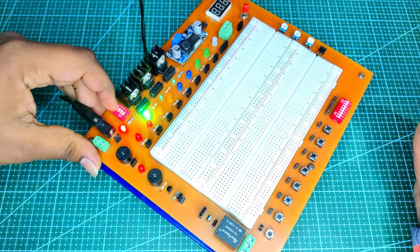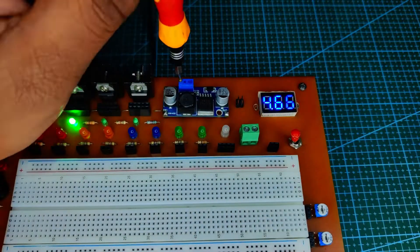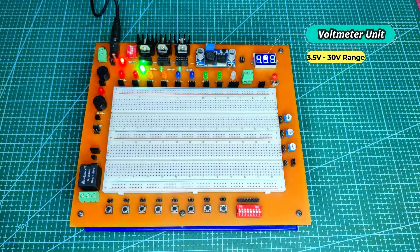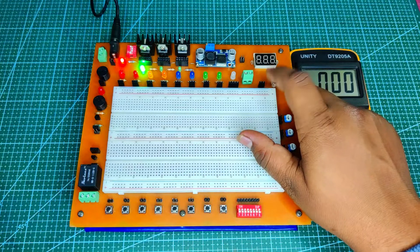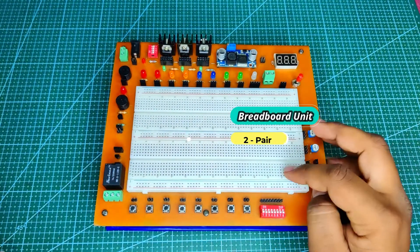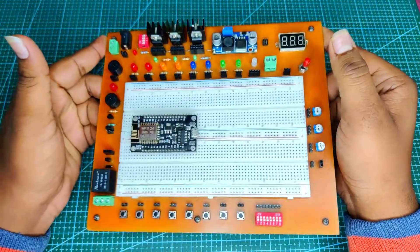The most useful feature of this board is the voltmeter, which measures DC voltage from 3.5V to 30V, though in actual testing it can measure up to 35–36V. Its main application is measuring the output voltage of the on-board variable power supply unit, and it avoids repeated use of a digital multimeter. By changing the position of the toggle switch, users can also measure external power source voltage. With two breadboards, users can easily construct circuits including ESP8266 connections that wouldn't be possible on a single breadboard.